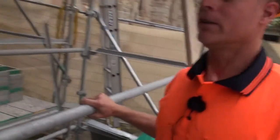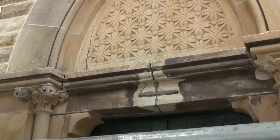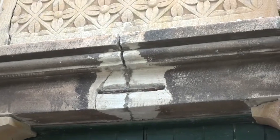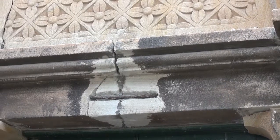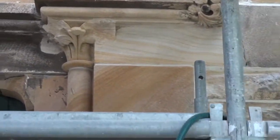As you're going up, you might be able to see to your left — there's work on the lintel. We've exposed the lintel, and you can see an existing pin there. Since the pin has been installed, it's cracked again to the left. And on the inside of that lintel, we've discovered that both down the left and right door reveals they're cracked again — so that lintel has failed in about four spots. At the moment it's being held up, we assume, by the timber door frame. So if you remove the timber door frame, that could possibly fail even further.